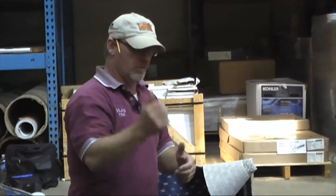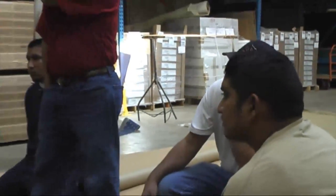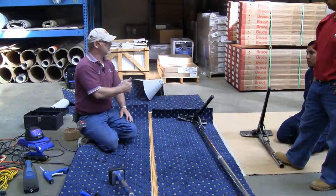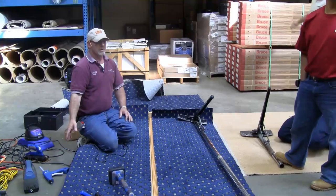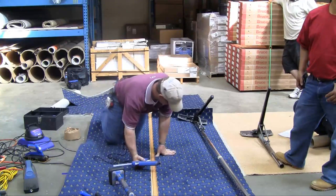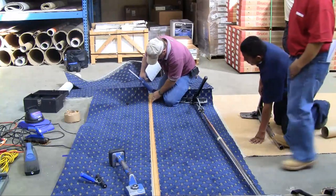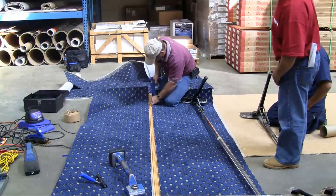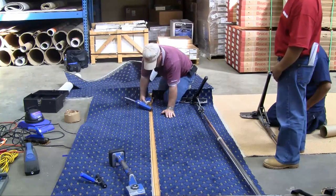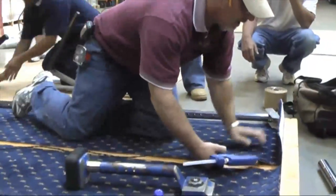With this, you run it on. The most common issue is guys put too much on, which causes a gap. You put it on just like you do latex — you run your bead down, then take your thumb or finger and rub it into the picks on the side. That's all you want to do with this. Use the edge as you're running it to push it in so it locks in. Just constantly run a little bead as you go, pushing it in at the same time.